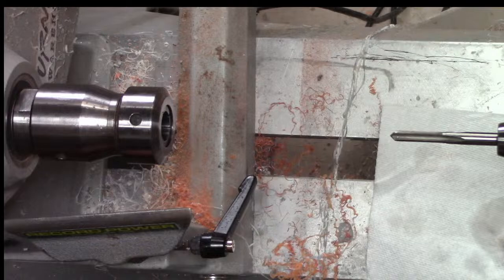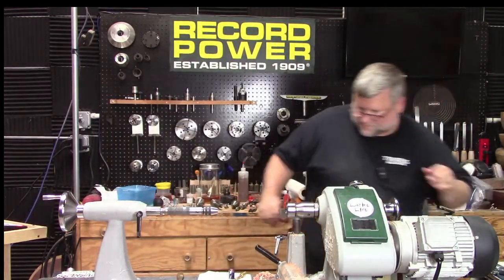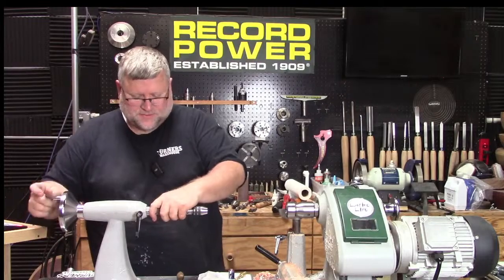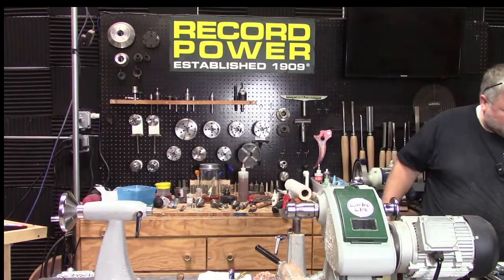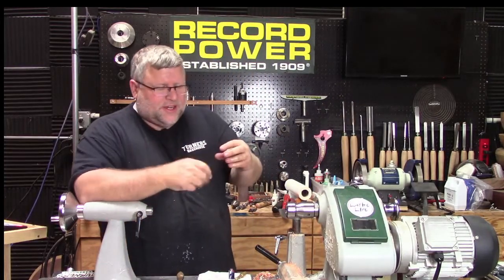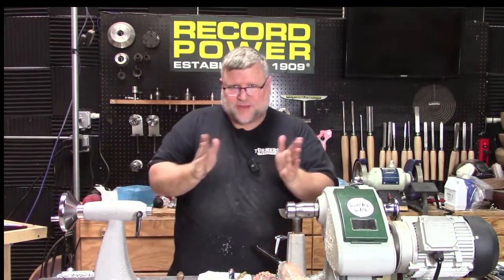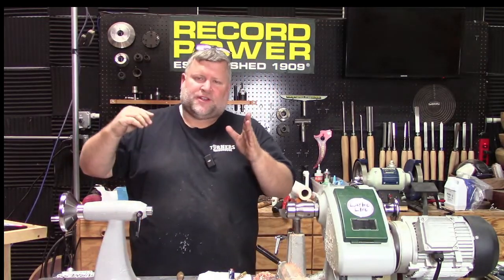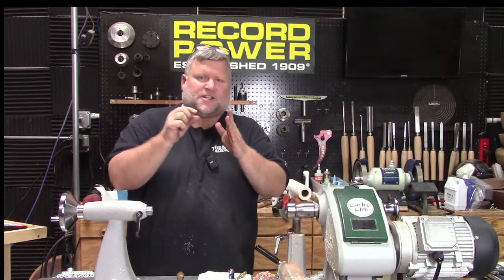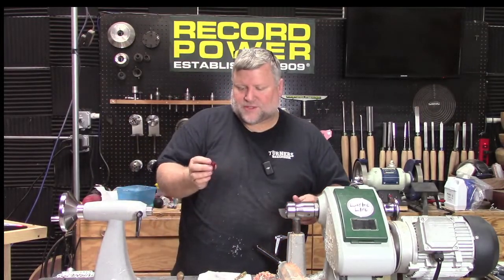So this is a section nib. Here, let me clean this up a little bit. We're done with this guy. So much work just to hold a nib. Now, when you do this the first time, if you put your nib in and it just spins, it doesn't catch the thread, or it threads in and then it's sticking out, it's usually just a measurement and drilling issue. If your nib goes all the way in and spins but doesn't catch the threads, it's not getting to the threads. So you may have to drill your collar a little deeper to allow the nib to slide in a little more to catch those threads. And then you can face off the front, which is what I'm going to do with this one.